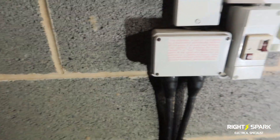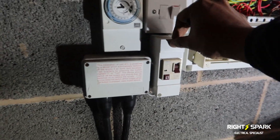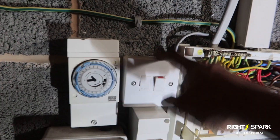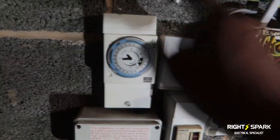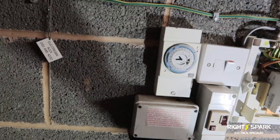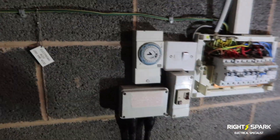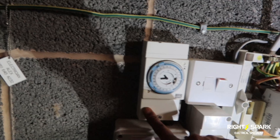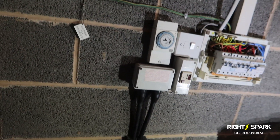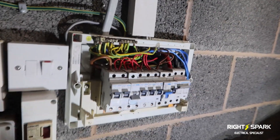On this side there's a few spares which feed the outside on a timer — an outside light on an armoured cable. There's also an RCD here, which is a bit weird because it comes in through a 30 amp fuse and then it's a bit of a mess, and the RCD won't go on. So I'll have to take the whole thing out, find where the fault is, and fix up the mess. Instead of the timer, we've decided to go with a photocell sensor, so in the dark it'll just come on for all the lights outside.